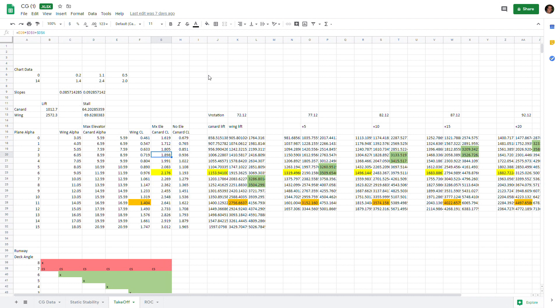Back to Mark's numbers. We're shooting for about three degrees nose-up attitude to get the airplane airborne. If you take three degrees and do the math - taking the sine of three degrees and multiplying by 105 inches - you end up with about 5.49 inches. That's how high the nose wheel will be off the ground: plenty of prop clearance, not a crazy sight picture, and less than what I had it off the ground that one time.